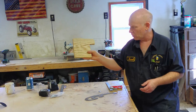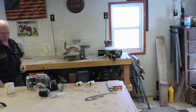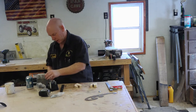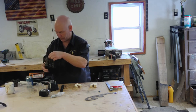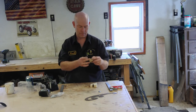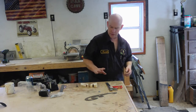All right, there are my two shapes. I'm going to go over and cut these out on the bandsaw. There are my basic shape wall hangers — you might be able to guess what's going to go in them. On the fronts, I think I want to go ahead and do a roundover. Another high-quality set of tools — another Tool Shop from Menards, about 15 bucks. I'm just going to do a quarter roundover. This might be a stupid mistake because when it gets down to these notches it could open up a gap, but I want a roundover on there. I'll put this in the router table, swap out the five-eighths straight bit, put a roundover on here, and then we'll finish these things off and get them on the wall.